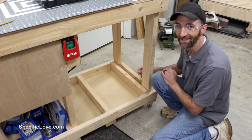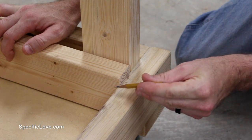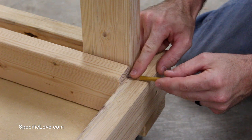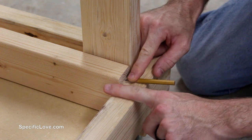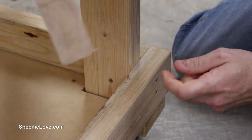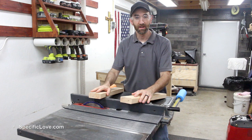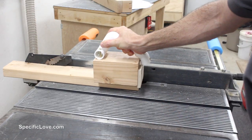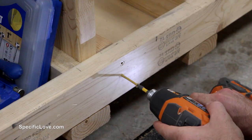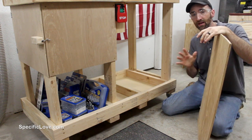There's a quick and easy way to mark the 2x4s to the right height rather than doing a bunch of measurements. Because of the curved factory edges on a 2x4, just taking a pencil across might give you a mark that's too low. Here's the trick: put your finger right on the top of the sloped area to level the pencil out across the top of the board, then carefully run your pencil across — that mark is now level with the top even with the curve. Then I use the table saw to cut them to size. For the floor and base I'm using an old piece of plywood about three-eighths inch thick, which should be plenty of strength.